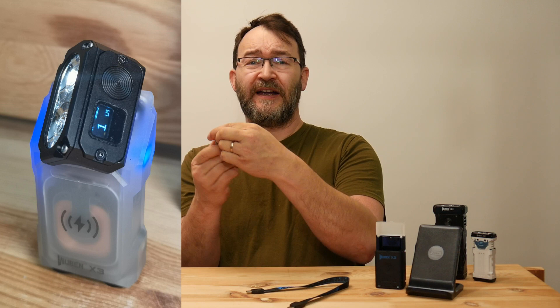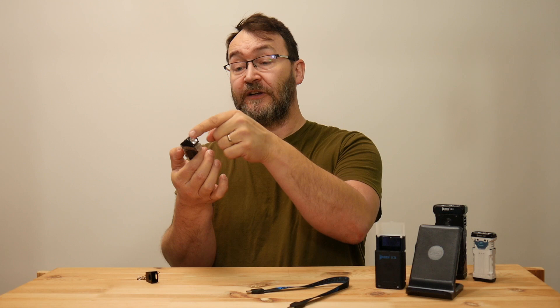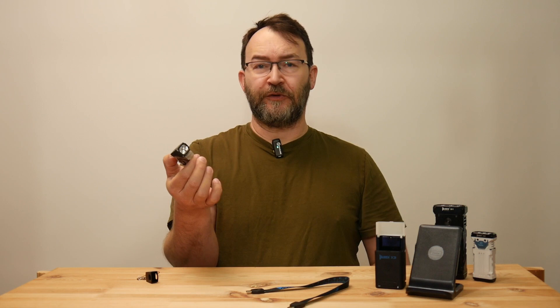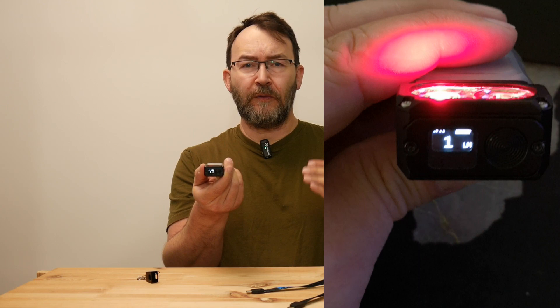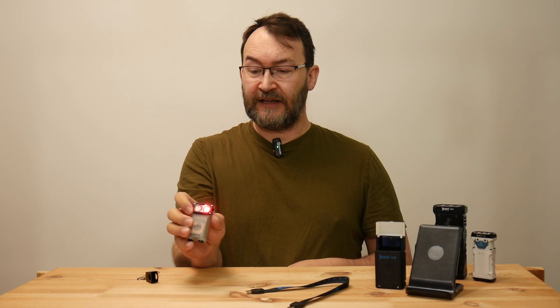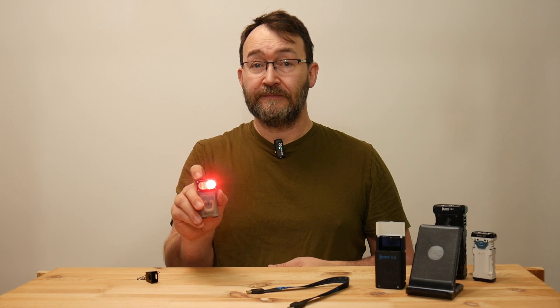Another thing is we have a kind of two-part flashlight: the head, which is made of metal, includes the electronics, the switch, the display, and the LEDs — everything where heat is produced. And it's separated by this swivel from the plastic body, so the body of the flashlight does not help with heat dissipation at all. I will come back to that when I show you the numbers. The switch is very nice and the display is easy to read, but the display has too small an opening in front of it, which always blocks some of the information. When you hold it in your hands, a third of the screen is easily blocked by this small window.